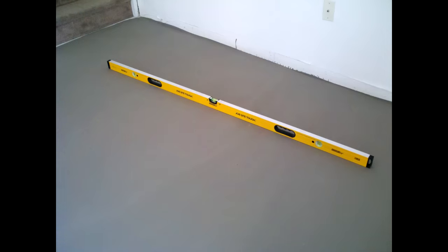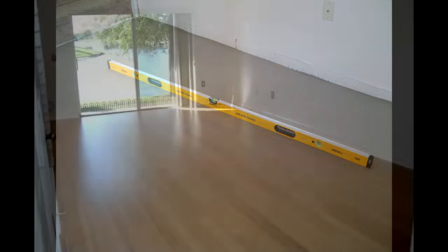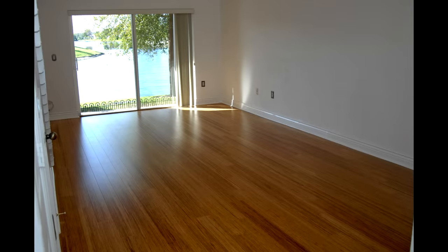The next day we come in and lay down our six-foot level — and it was perfect. It just smacked down. When you have a perfectly level floor and you set down your spirit level it will just smack down perfectly. There was essentially zero variation across six feet, which is textbook perfect according to the Tile Council of America. Now you're ready to start installing your bamboo flooring. Here are a couple of pictures after we installed it — just perfect.